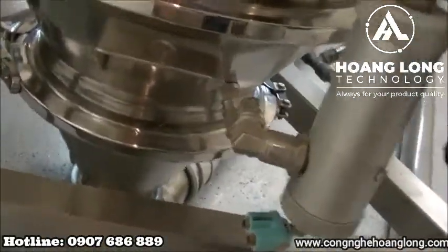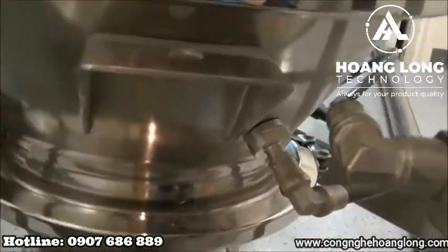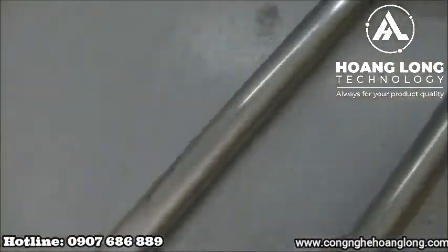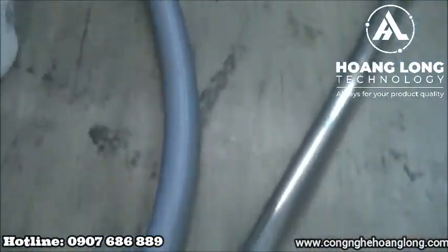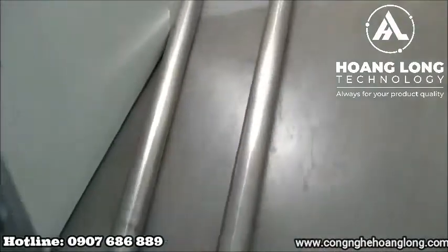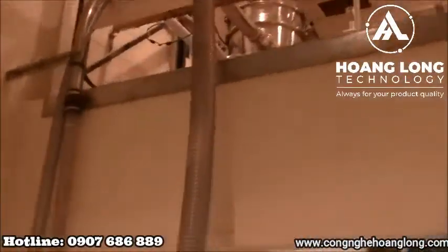possible. The feed station is also fluidized, so behind this cone here, there's a fluidization cone, kind of like an air hockey table. Give a nice fluid bed for product to flow directly into the product stream, preventing any bridging or rat holing. Product will then convey down the convey line here through some stainless steel tubing, through a section of flex hose around the bend here, and back up against some more stainless steel tubing, up into another bend here, where the product will then convey up into the mezzanine, into the PIAB.